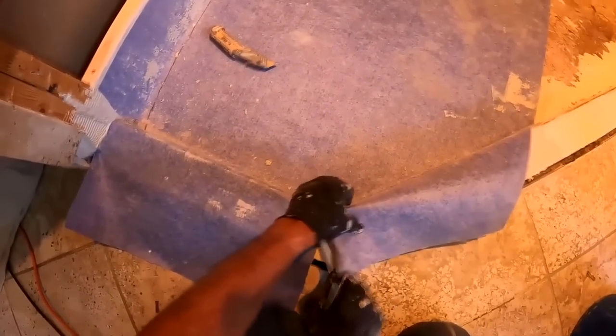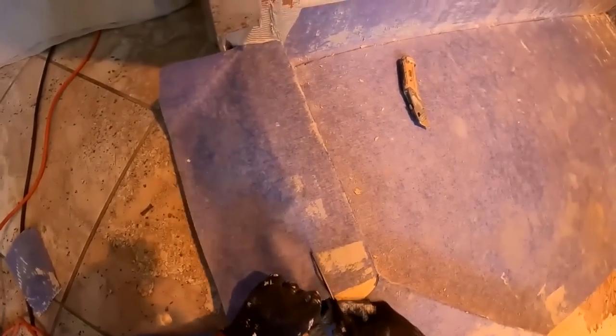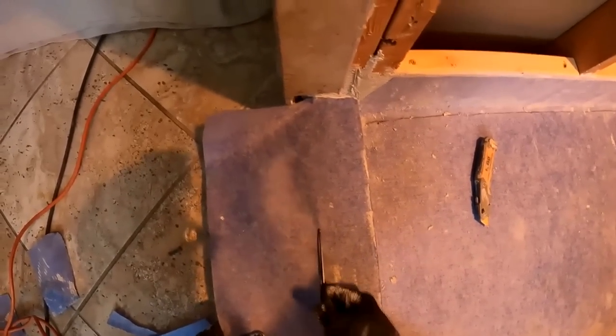Also, the excess material that's hanging over the curb, I'm not gluing to the outside of the curb. There's really no point. Water is not going to see the outside of the curb, although I think I waterproof it with the Ardex layer just for kicks and giggles, but I just cut off the excess at this point. Yeah, once the whole process is done, then I wait overnight and let that dry before I pour my pan. Here I'm cutting off the excess.